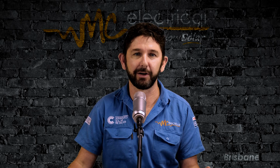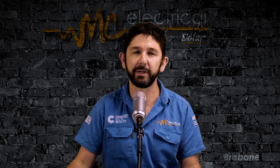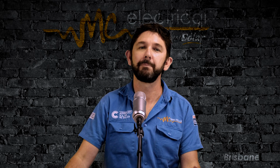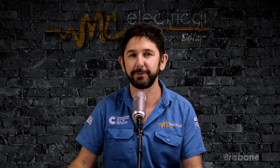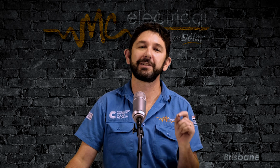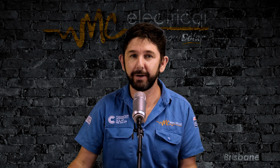Yes, 8 kilowatts of solar panels is well oversizing on a 5 kilowatt solar inverter, but it was winter time and I faced the panels east and west. So it was a very similar sort of output to installing a 6.6 kilowatt solar system facing north in summer. So how did SolPlanet compare to Fronius? So this is the part where you think that I'm going to say Fronius performs much better than SolPlanet. Well, no, not yet. So first I tested them under normal conditions on a clear day, and they seemed to operate around about the same.